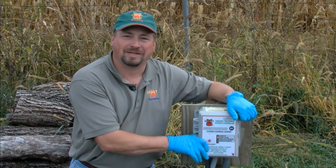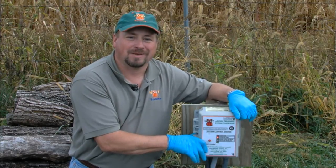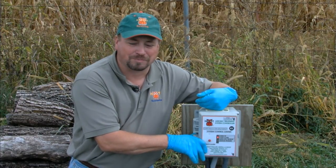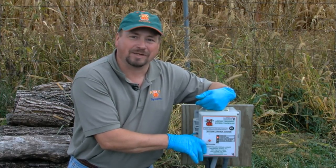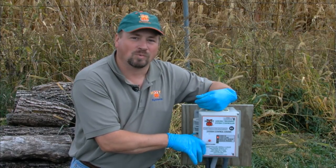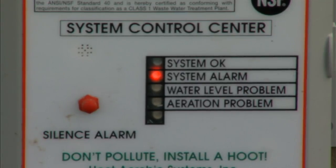In mode 3, the control panel gives an audible signal to indicate the back pressure on the treatment system. The system normally operates between 60 and 80 water column inches, which translates to approximately 2 to 3 psi. If pressure falls below 52 inches, we know there's a break in the air line or the blower is failing. If it goes above 100, we're not delivering the right amount of air. In this case, the audible count reads 65 water column inches present on the blower.